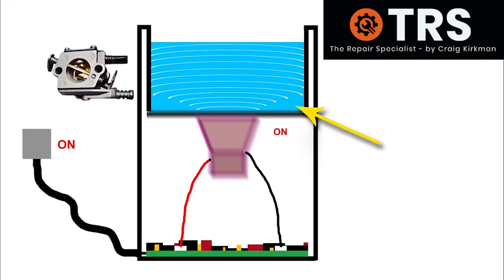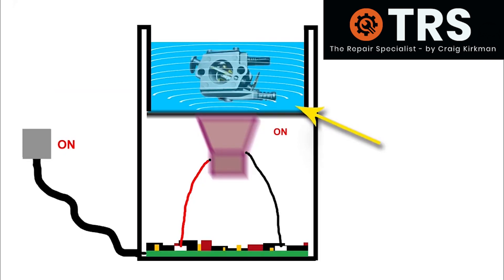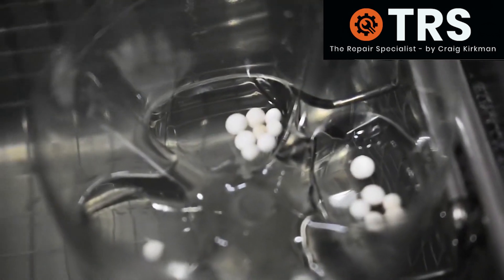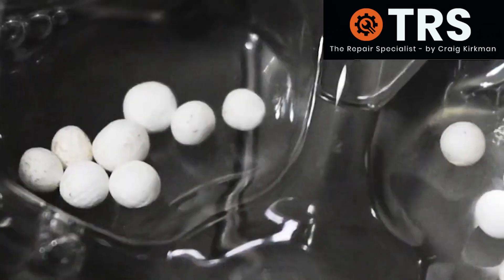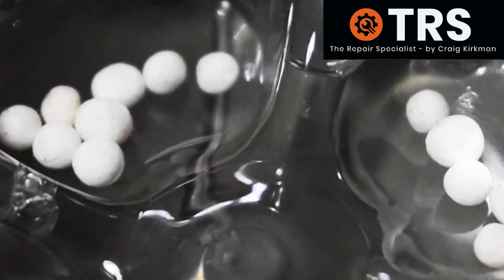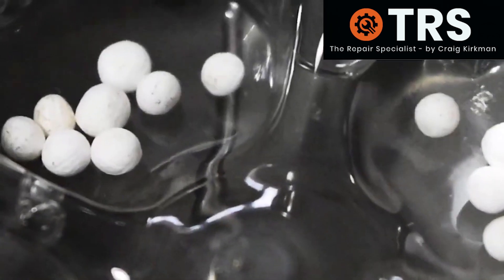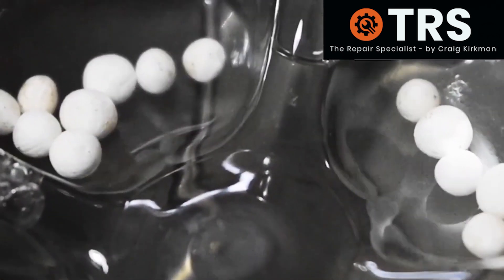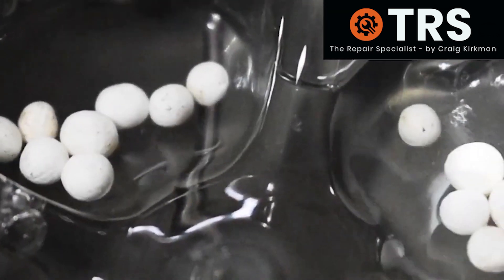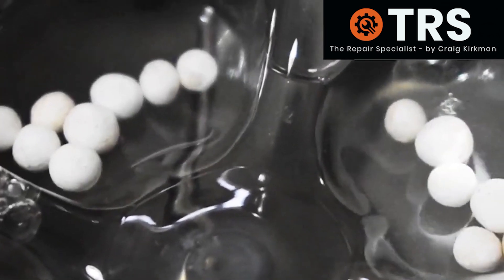The item to be cleaned is submerged amongst these waves, but the waves are so small it can be difficult to notice them with the naked eye. Even though they are difficult to see, their energies can be seen clearly when I place this plastic container with tiny polystyrene balls within it into the ultrasonic tank and turn it on — we can clearly see the energy of those waves moving the polystyrene. That's because the ultrasonic waves moving through the fluid hit the plastic container, making it vibrate and in turn vibrating the polystyrene.